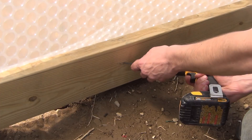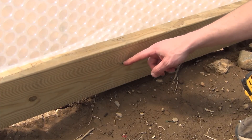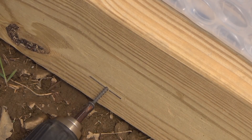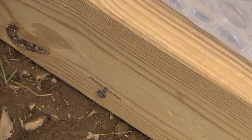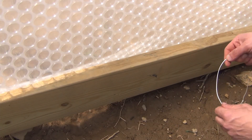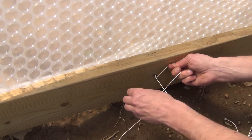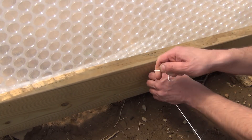So where I set these marks, every section I'm putting in a screw — this is my tie-off end, I put it at an angle, which makes it easier to tie off and secure my string. On my starting end, I'll put the screw in nice and straight, tie a little loop in the string, loop through it, put it on, and it pulls on tight. Then just wrap this on, pull it nice and tight so it doesn't sag. Just wind it on a few times — there's no need to even tie a knot, you just wrap it around and it will stay long enough to do what it needs to do.